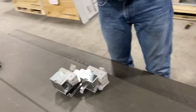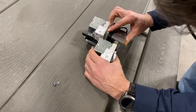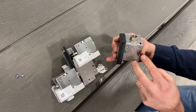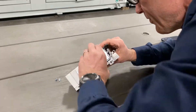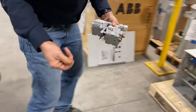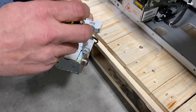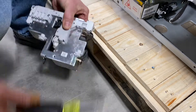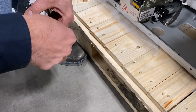We come over to the table here — it'll be a little easier to install this on the table. There'll be two screws that should be supplied with the release coil. For this one, the coil has two little divots right here; those divots will go into these two locations right here. Then flip it over and put your two screws in. These have Loctite on them to make sure they don't come out.